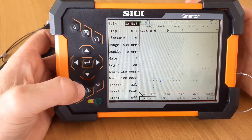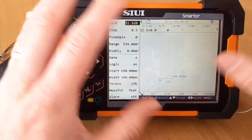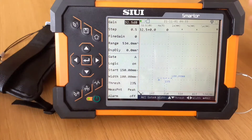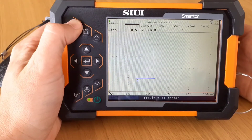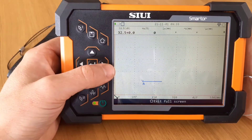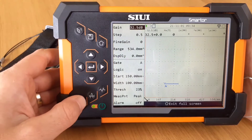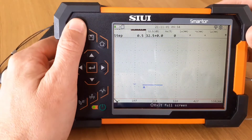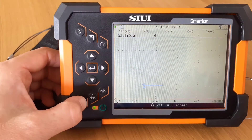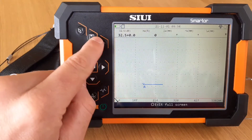Back to the menu. For the gate — quick access while you're doing your inspections — you can adjust your gates. These live F1 and F2 buttons are two separate buttons you can dictate what they actually do. F1 is set to full screen mode, so we've got full screen mode, we've got rid of our menus, and we can get on with our inspections — but still have access to our gates or gain adjustments. F2 is currently set to freeze, so if we're in full screen mode we can freeze what's happening on the screen, freeze the echo, do some measurements with the rules or make some notes. Pressing this button again, we can unfreeze the screen and go back to live readings.